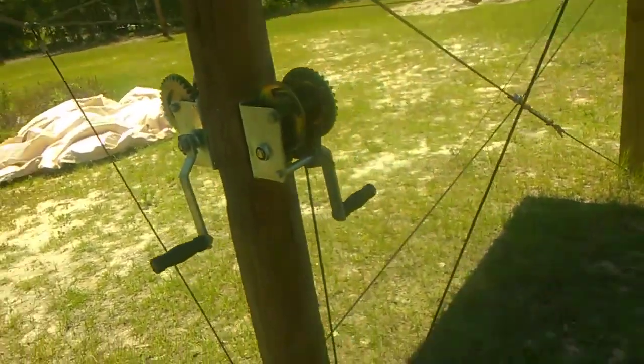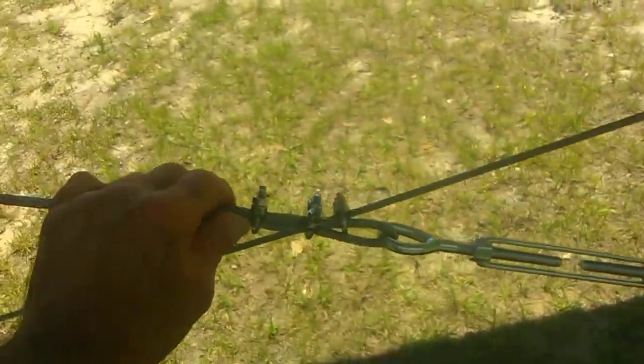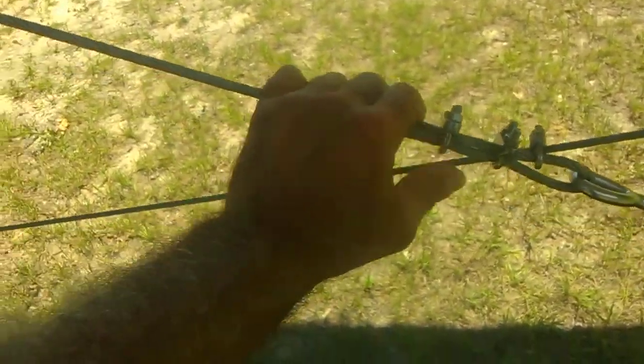This has been up about a year now. One of the things I'm worried about is the depth of the anchors — the ones I put in here were about two feet long, and if this thing gets some serious wind to rock it back and forth there's a possibility it could pull those anchors out of the ground. I may have underdone it — I would probably use something three feet long if I was to do this again.